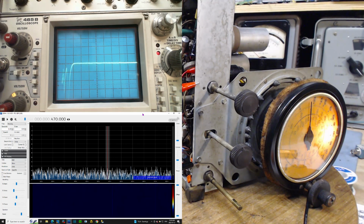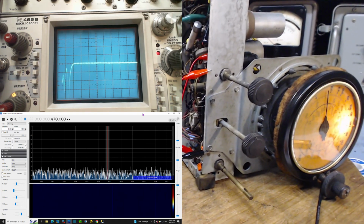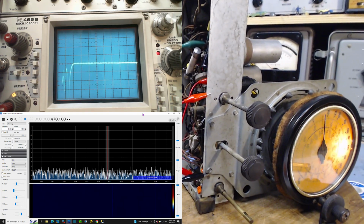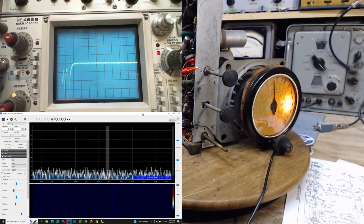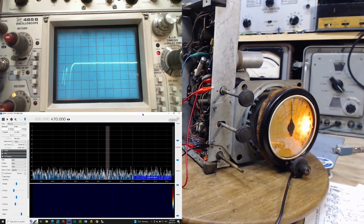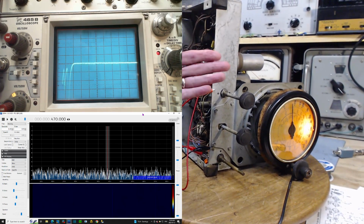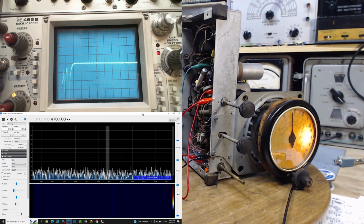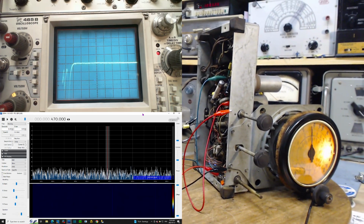And I don't want to do what I did to the other tube, which is put a little wire in. It's not necessary. I did it. I won't get into it. I think that might solve most or all of these weird oscillation problems that are happening in the radio. I'm not sure though. It would also suggest that these problems were endemic in the radio right from the get-go, when whoever changed the tubes from glass to metal missed the need to ground the metal shell. From then on, the radio must have misbehaved.